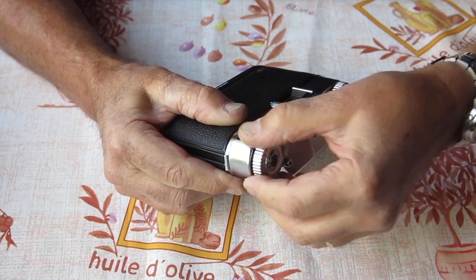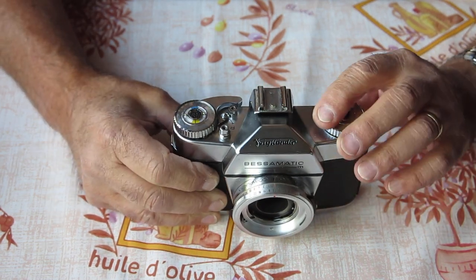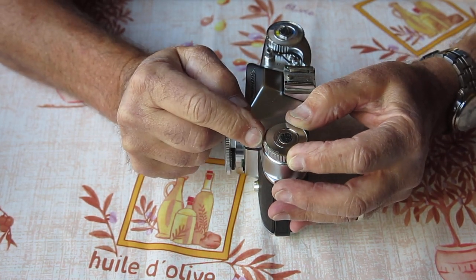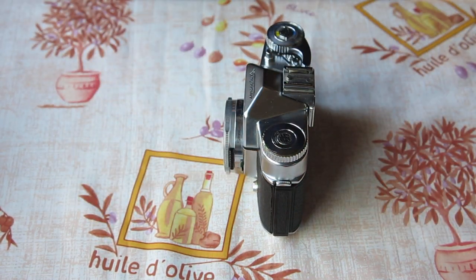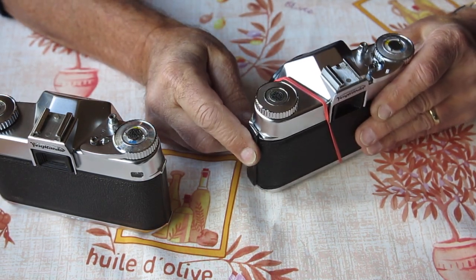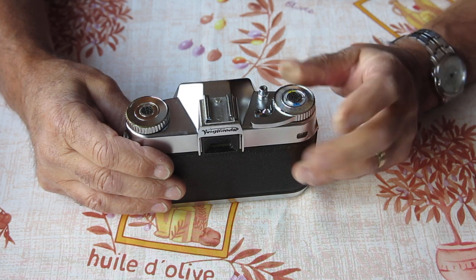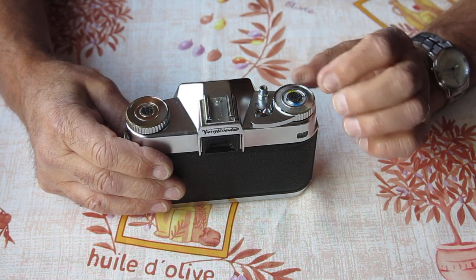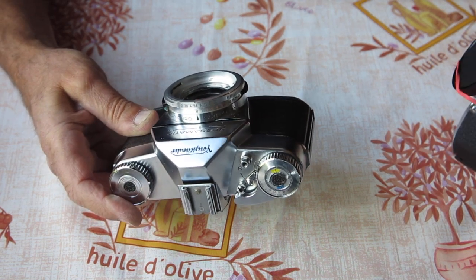Yeah, that film advance lever is just odd. That's just not sitting correctly at all. That's going to be one of life's mysteries that I'll doubtless find out more about. Here, on the rewind knob, the edge of that rewind knob is a bit scarred up, and I'll definitely choose to use this rewind knob when I service the camera. The advance knob on the camera I'm to re-service and repair is in better condition, so that's not a problem. I've just got to deal with that mystery of the lever sitting too high.